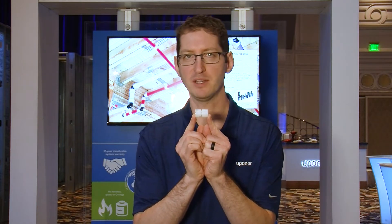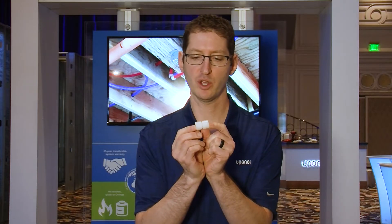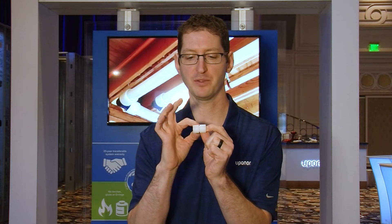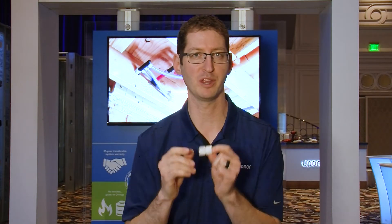One of the things I want to talk to you about today is minimum cut lengths. For all of our sizes of piping, we have a minimum cut length — that's the shortest the pipe can be before you start making a Propex connection. What I see sometimes is a pipe that's this short. We don't want this to happen in the field because the pipe loses its strength as you expand it. If I expand this pipe out, the wall thins and it doesn't have the clamping strength that it would have if the pipe were a little bit longer.